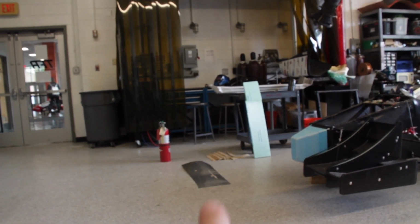I probably need to steam the cross supports for longer using that insulation right there and that piece of metal on the floor there to keep the steam in, so it actually does what it needs to be doing, so that it softens those supports up more than they were. The problem is I only have 4 in there right now, and I need 32. So I'm only a fraction of the amount of supports and the amount of pressure that I'm going to be putting on this press, and it's already failing, which is not good. So I need to go backwards so that I can strengthen this thing up, so that when I go forwards with the project, things turn out correctly.